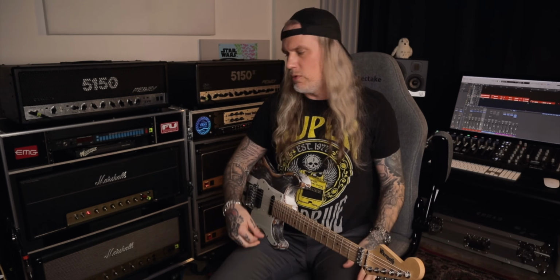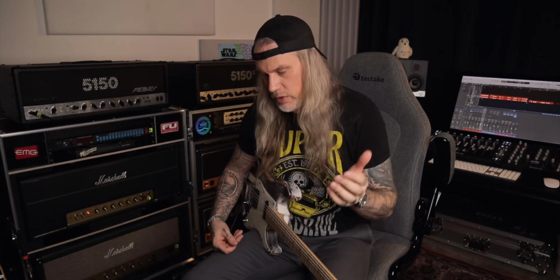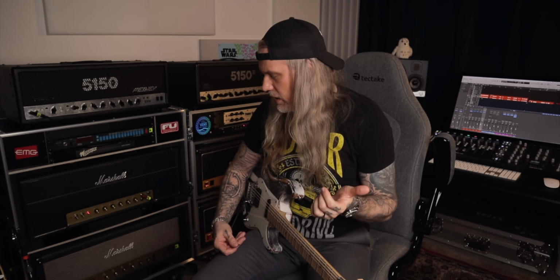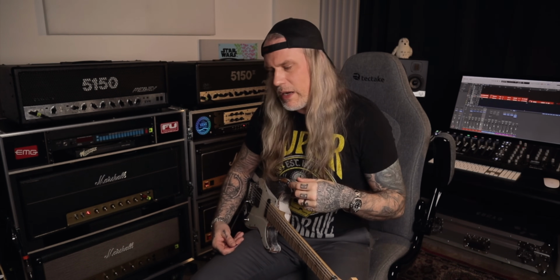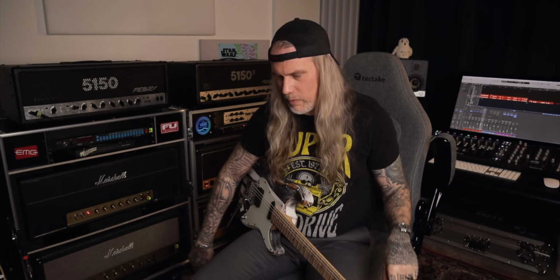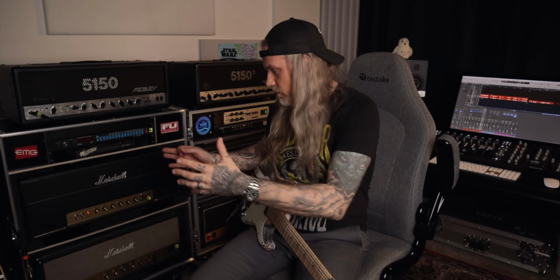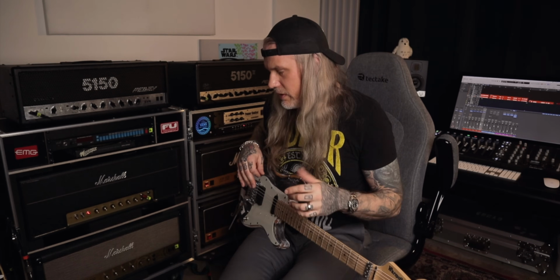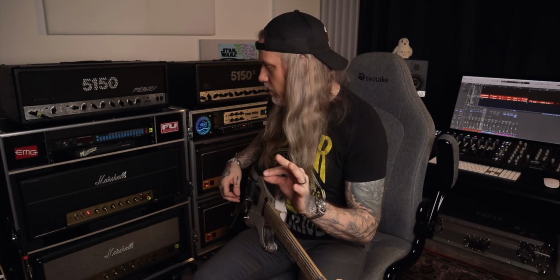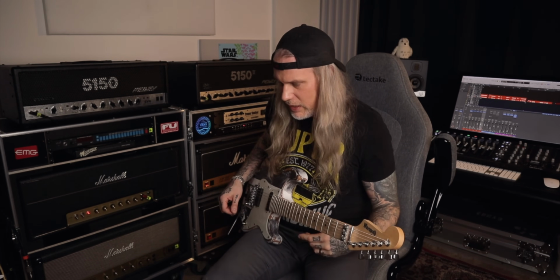Okay, so now the amp is, if I've understood correctly, pretty much in the specs of Eddie's famous '68 Plexi, I believe. It wasn't really modded, I think, but back in the day, Marshall just put in whatever parts they had at the time, and Eddie's just happened to have these parts. So there are no gain mods or anything. There are just different valued components, and the 6CA7 tubes, which does a lot, and the Variac.